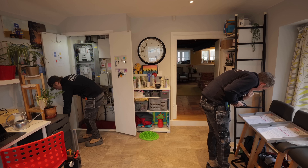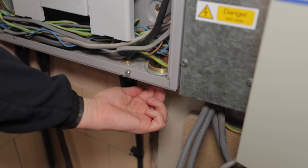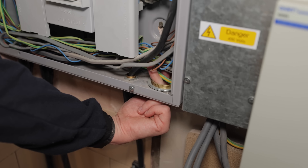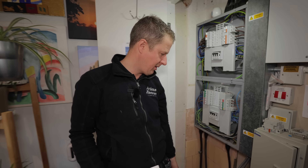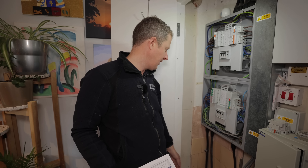There are a few anomalies here, such as one circuit being labelled as unknown. This was coded as a C1 — you can stick your fingers in there — but there is no access to live parts, so I would say it's probably a C2. Unless your fingers are like a foot long, unless you're Edward Scissorhands.